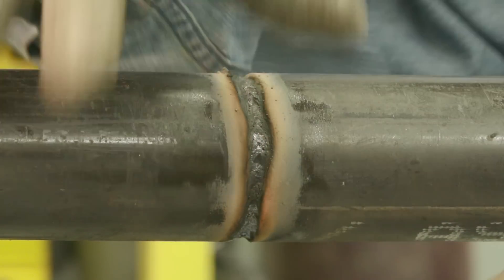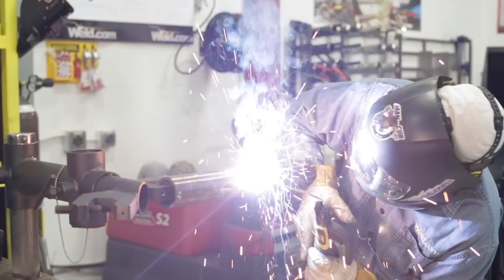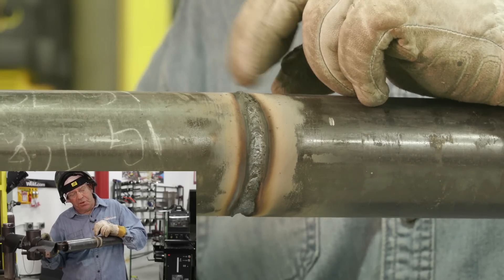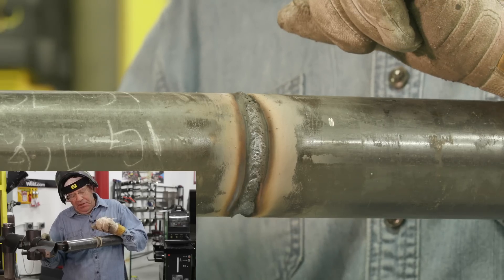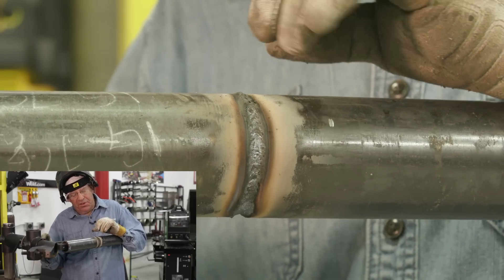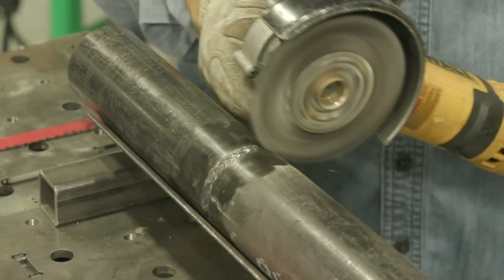Well, that went fairly quick. So now I need to go clean my start and my stop. I've done both sides. I'm going to buff this off. I've got a restart up here on top that I just want to feather back and make it the same depth. It looks like I do need to run a fill and bring this up to flush — I don't think I could go to cap right now, I'd be fighting too much metal. Small bore pipe. I just want to clean this top out and clean this surface.